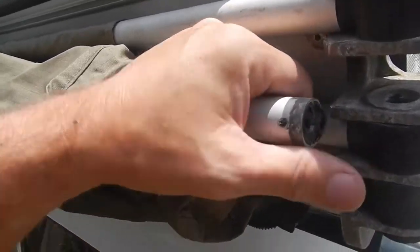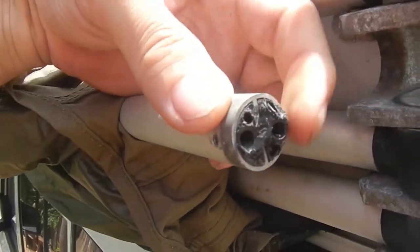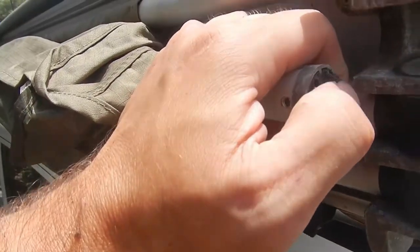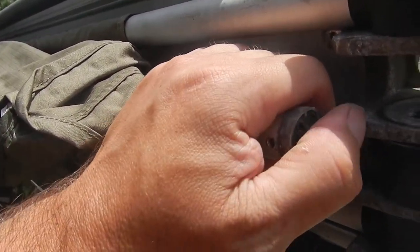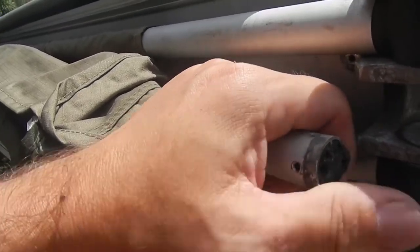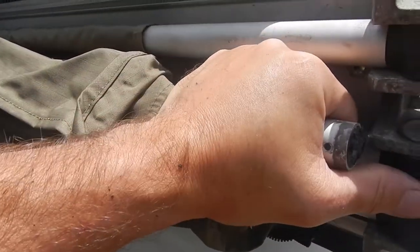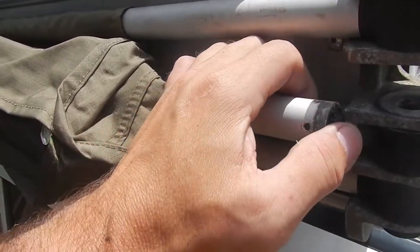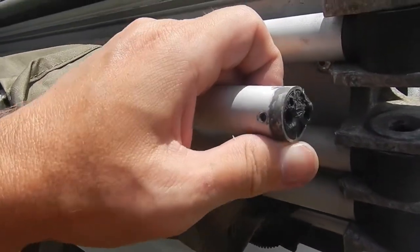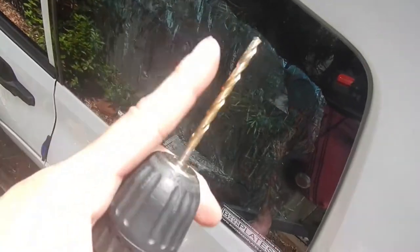Okay, so there's something just to be aware of here. I did start off drilling out the small holes, probably a few mil, and I'm stepping a drill bit in here. Whilst not typically hard to drill, this material creates a lot of friction — it really grabs the drill bit and heats up very, very quickly. There's actually heat in this section and in this crossbar. So take your time drilling these holes out and have a little bit of a break in between, because those drill bits are heating up very, very quickly in this material.